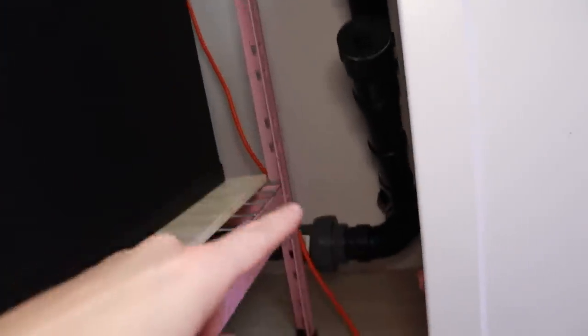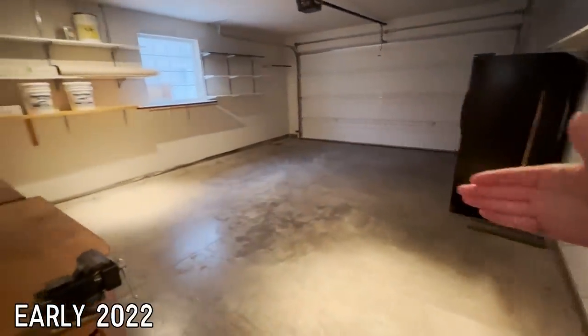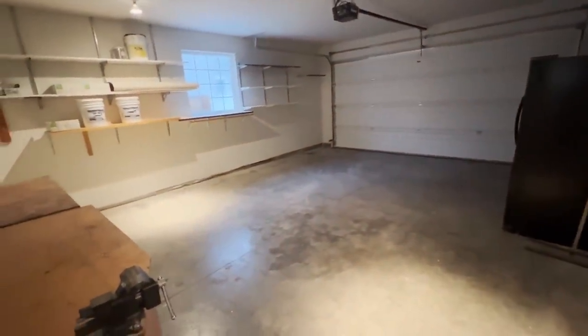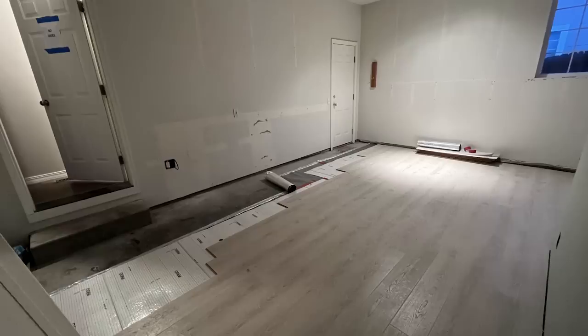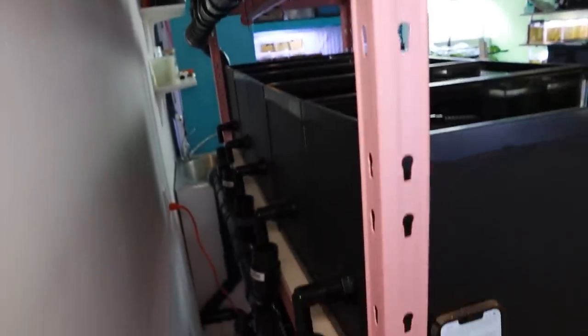The water will flow down my wastewater lines and it goes through a little hole in my wall. That hole goes directly to the crawl space and attaches to the main drain line of my house. The reason I had to do it like that was because I'm in a garage — just over half of this space is going to be my new studio. It's half my garage with a partition wall finished out like a room, and that's just the only way I could possibly get a nice automatic drain line. This hefty-looking plumbing back here brings the water down to the crawl space.